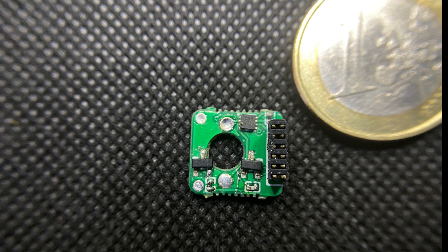Of course we still need a DC motor driver. I chose the DRV8837 for this. It comes in a tiny 2x2mm package and is able to control the motor's direction and speed via PWM signals. It is also capable of stopping the motor and holding the load.